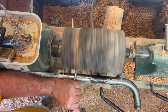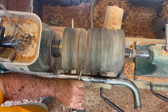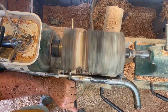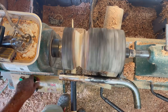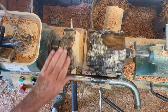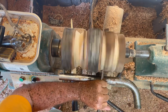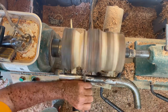What I'm doing here — I've already turned some of this cherry log and I was trying to do some natural bark, but I kept losing the bark. This piece is cut out of the same log. What I did was take shellac in the areas I was going to keep the bark on — I soaked the shellac in two or three times to help glue it, and it worked. I've used it several times since then.